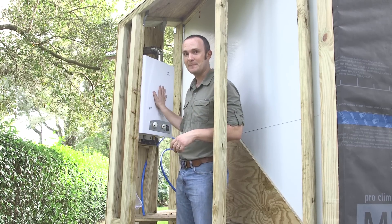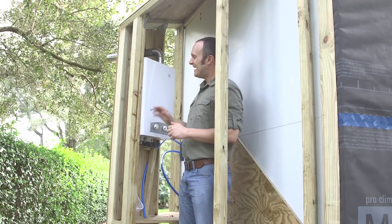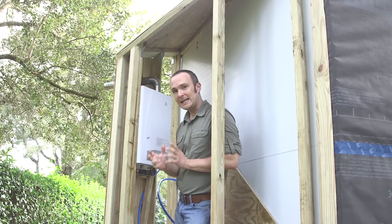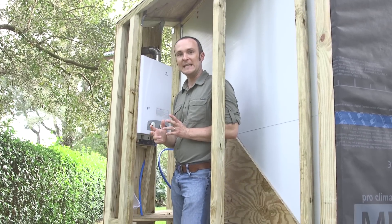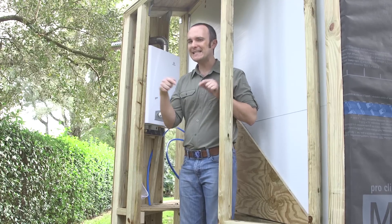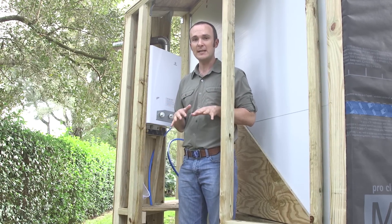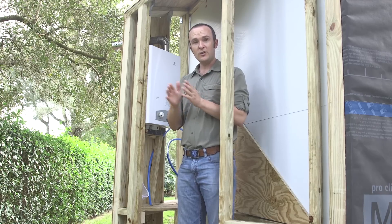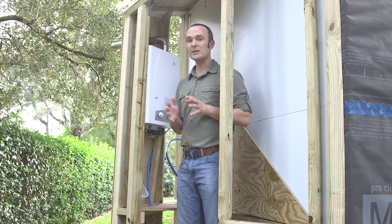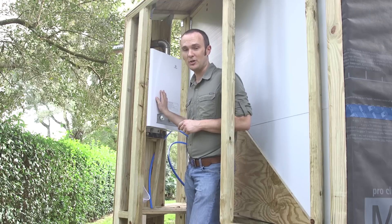The first thing you'll notice is here — I mentioned this when we were talking about the shed I'm standing in, which is also called the mechanical closet. This is our water heater. In a tiny house on wheels situation, our water tank is going to be kept inside the house, which means it's going to be the same temperature as inside the house, about 70 degrees. Your water at home comes in at ground temperature, about 55 degrees or sometimes less, so this water heater is going to have a lot less work to do than in a typical home.